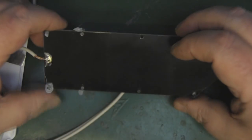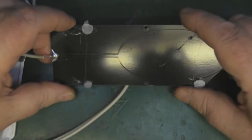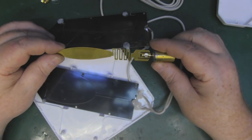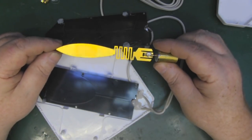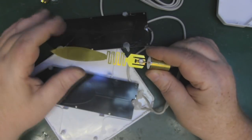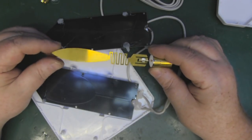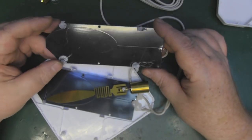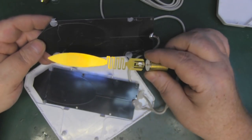This probably isn't as good as the built-in antennas you might find inside your 3G/4G router. Now, I've found the Cisco antenna I was talking about — it has this elliptical piece on the main driven element, and it's much more sophisticated with a loading coil, side lobes adding inductance and capacitance, tuning it in for a much better VSWR. The cheap eBay antenna has a really high VSWR, probably because it's such a basic design.